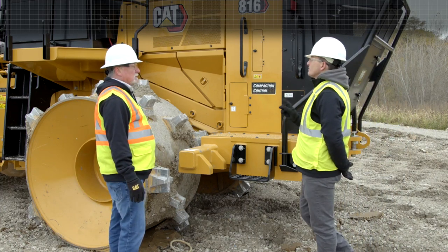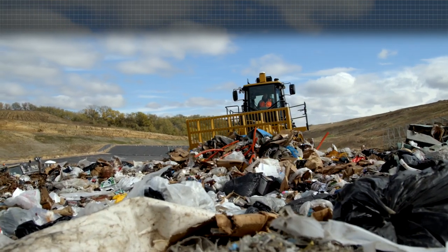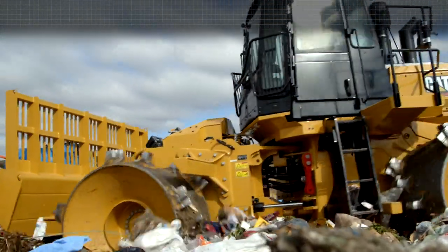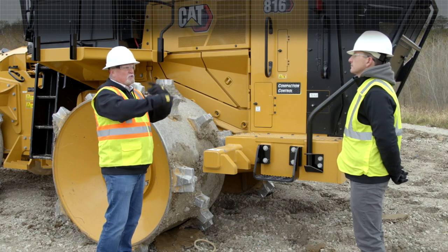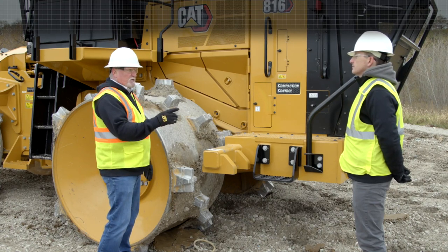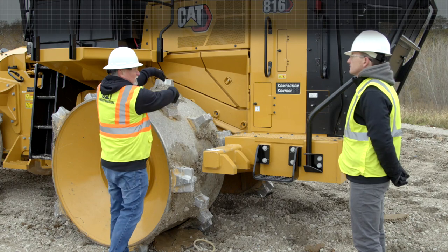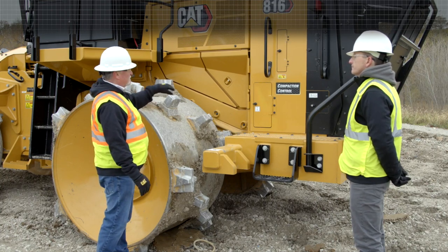Let's talk about how we protect our axles with the dual cone seals and axle guard system. Because the wheels are turning and we have these cleats on the wheels, that tends to pick up debris and it can rotate around forward and reverse and work its way in around the axles. So we have an axle guard system that is part of the wheel — a welded-on or mounted-on labyrinth system. The wheels turn inside the labyrinth system, so if material gets around it, it turns with the wheel and doesn't bind up tight. Also, through our alliance with M Squared Industries, we now have access to what we call the cleat guard — a debris dam on the inner row of the wheels. It prevents material from going in and falling down — it hits that wall and comes back out into the landfill where it gets compacted down. So we prevent all that axle wrapping.